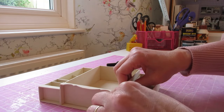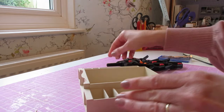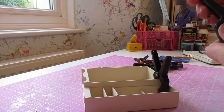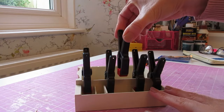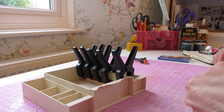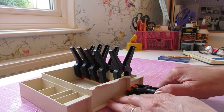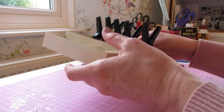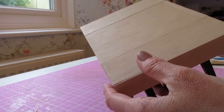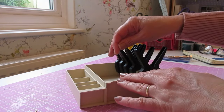Lay that down so that the back of each piece is flush, make sure you've got that nice flat bottom edge and flat at the top. Pop the larger clamps into place, and put a couple along the moldings at the bottom. Have a look at that back edge — it's being held together nicely, but if you did have any gap then just pop some masking tape across. Leave that to dry.